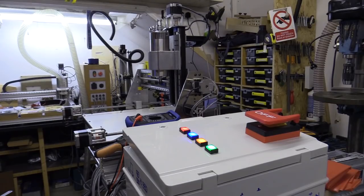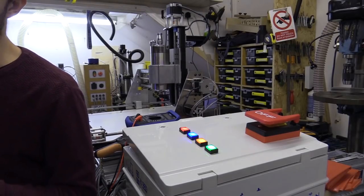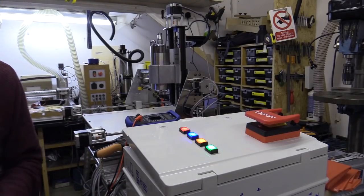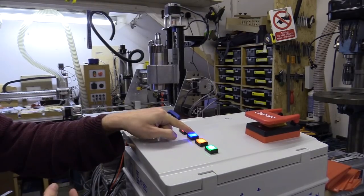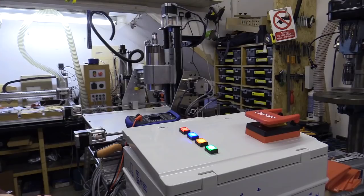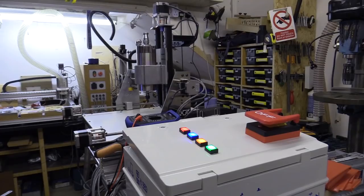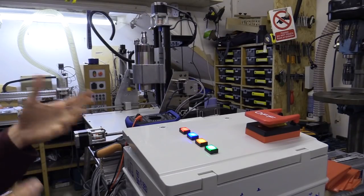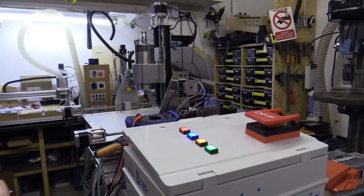The resetting of the axis work position is something that has annoyed me for quite some time and was probably the straw that broke the camel's back, starting me on my journey into building CNC machines. Simply put, the G92 position register or set-position command will reset if an M30 command is executed at the end of a G-code job or if the GRBL soft stop is pressed. This will affect restarting jobs, and instead of G92 it is recommended to use a G10 set tool offset or programmable data input command. Now I've got that off my chest.